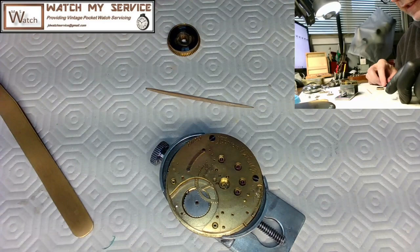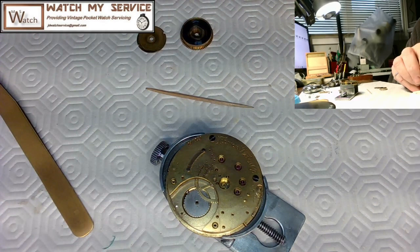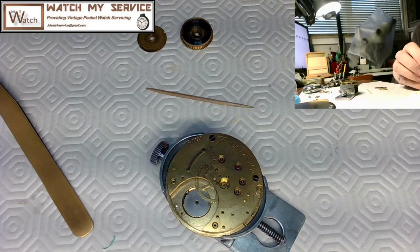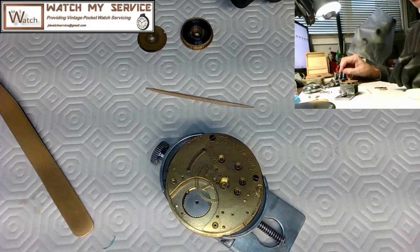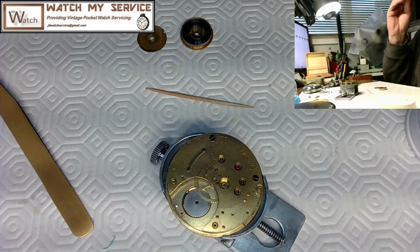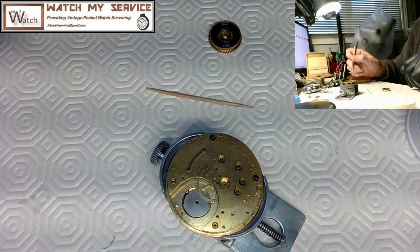I already oiled the bottom. I'm going to put just a bit of oil on the lid as well, because that's going to be in contact with the arbor. It's already 4:10 and I've got to finish this before my wife calls me for dinner. Don't put any oil around the edge because you've got to snap the lid back on. Before I snap the barrel on I need to put the arbor in first — good plan. The direction of the hook tells you how the arbor goes.